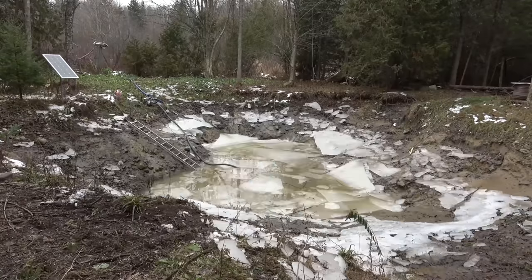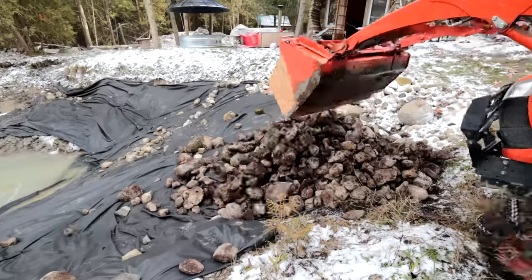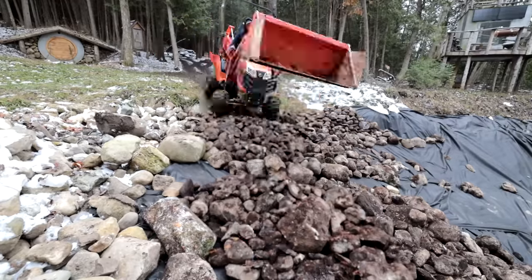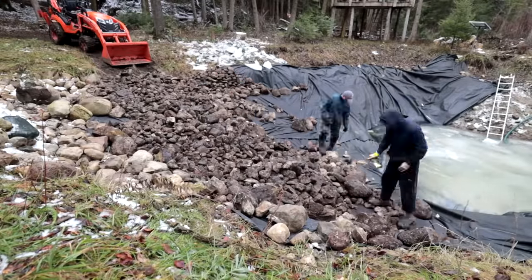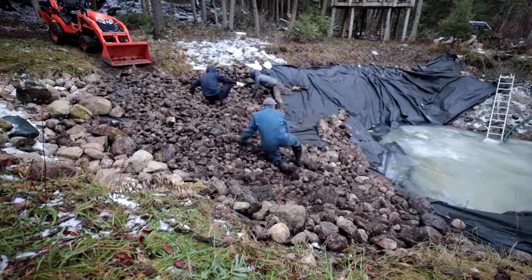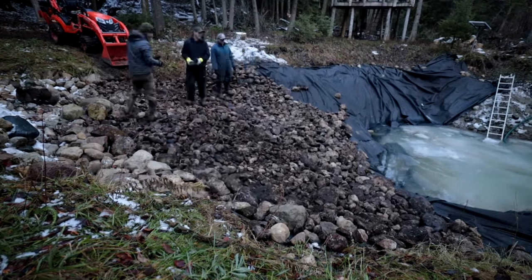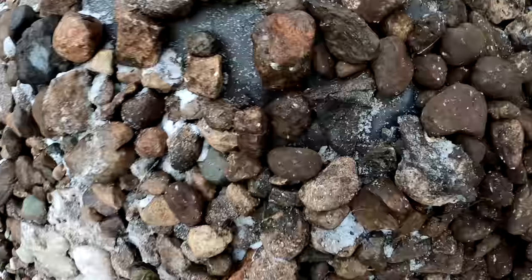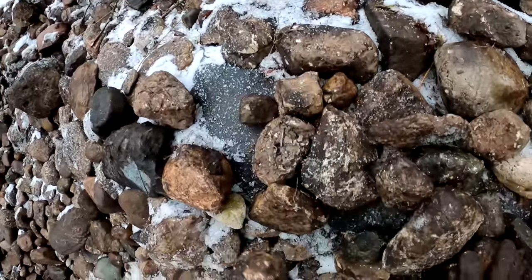Over the course of the last few months we've put a ton of energy and labor into this pond. We drained it and covered it with geotextile fabric, then put in ten days' worth of fieldstone collected from nearby overburden. Geotextile is a plastic-like material mostly used for erosion control and roadways — it comes in a wide 15-foot roll and is fairly easy to work with, though it does float, so the rocks help it sink and form our base layer.